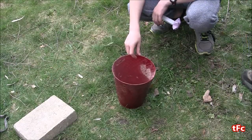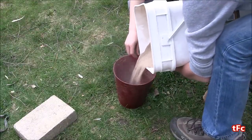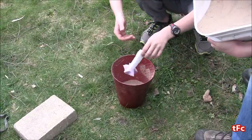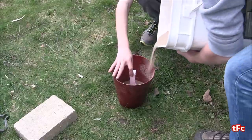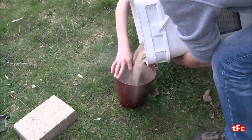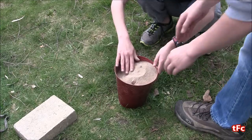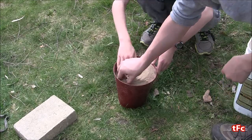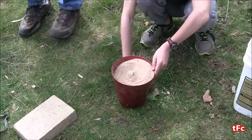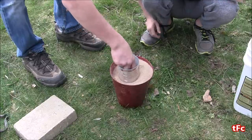Alright it's now time to set up the casting mold itself. So I'm going to start by pouring some sand into the bottom of a steel bucket and just fill it up enough so that the star can sit in there without going too high or too low in the bucket. So now I'm going to place the star inside of the bucket and start pouring sand all the way around it, making sure to fill all the gaps so that I get enough detail. Keep doing that all the way until the top. And once the sand is at the top I'm just going to smooth it out a bit so that I can see the styrofoam and make sure there's a little bit of styrofoam sticking out. So now I'm going to take a little steel can and put it right over top of the foam bit sticking out — this just helps guide the aluminum down into the foam star.